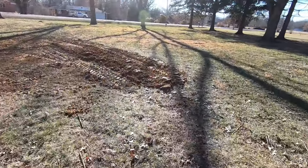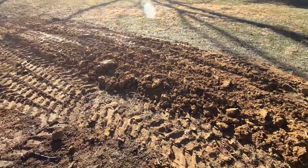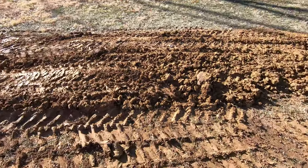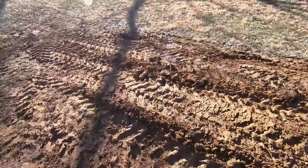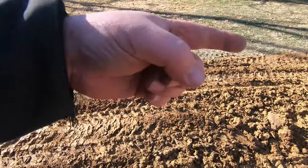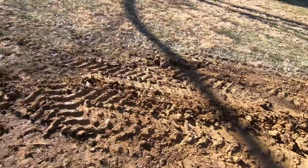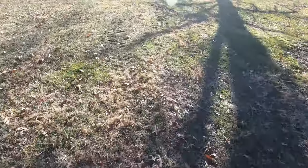Here's what we ended up with. We had about a ditch about 20 foot long or so here. It would have been just a small hole, but the finger pulled off the poly somehow or another, and I ended up pulling the cable into the old pipe over here, but the poly stayed over there. That was a problem. So we just opened up the hole, we found the finger, reattached it, and kept on going.